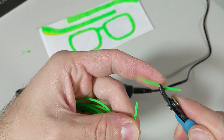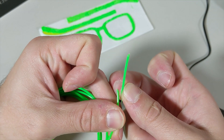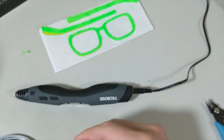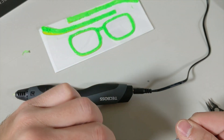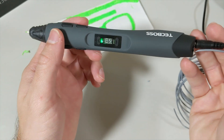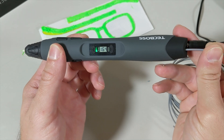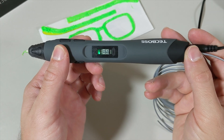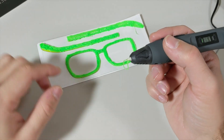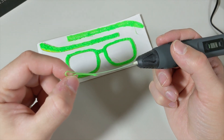When your filament is unloaded, cut off a bit from the back because there are sections that are bulged due to heat — if you plug it back in like that it will clog your nozzle. Now with the new color PLA, I click the loading button, put the filament in from the back, feel it going in, and wait until the new material comes out. Now the old color is being extruded and the new gray color is coming through.